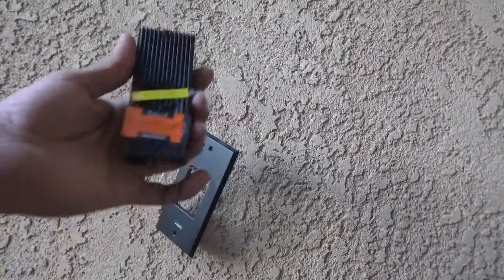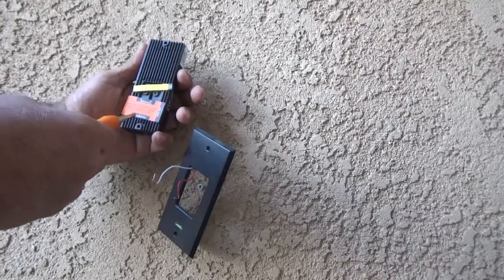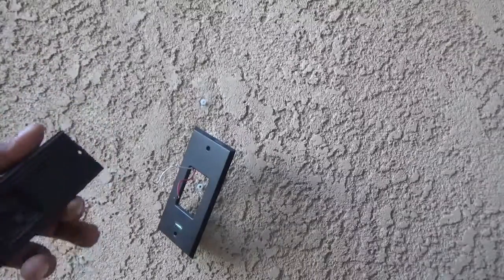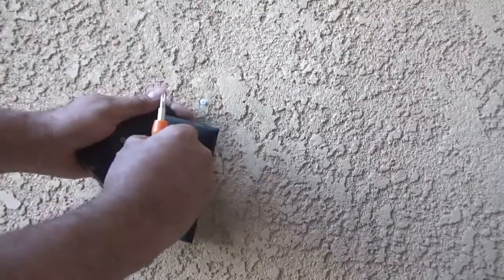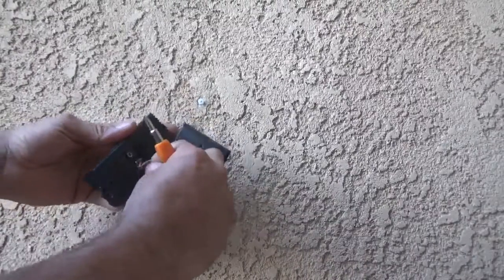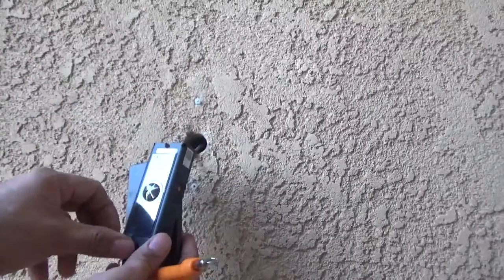That's the new one. After wiring your device it may take a few minutes to power on. The instruction says to wire from a doorbell where the voltage is off, safely up to 24V. The wiring is not a big deal — it's not hard to do. There are only two wires and two terminals on the doorbell. Wires are connected, and as they say it might take a couple of minutes to come on.